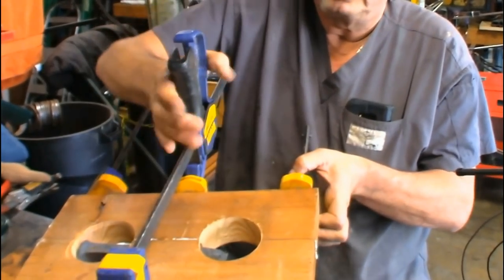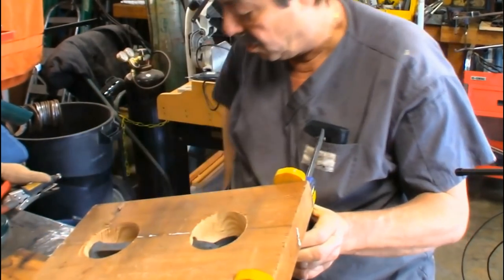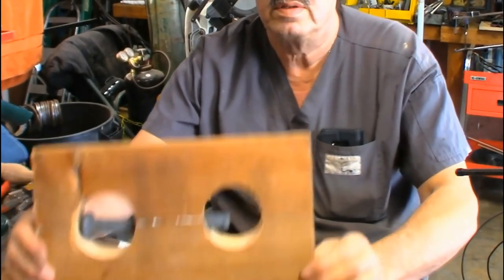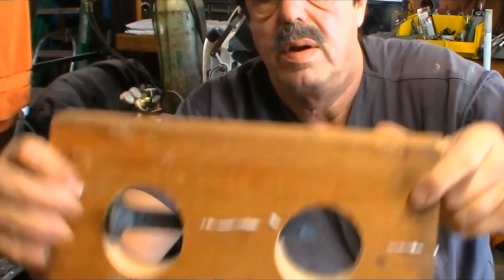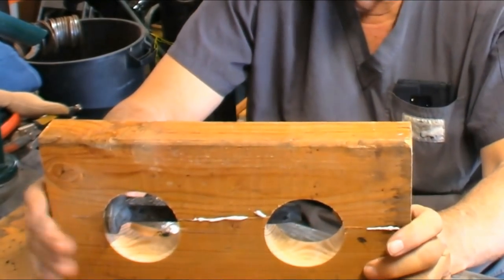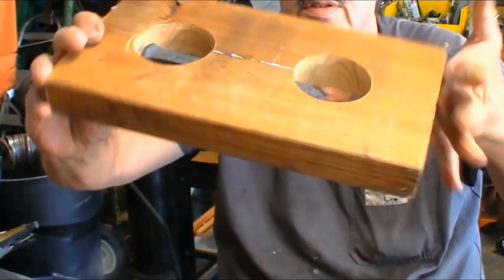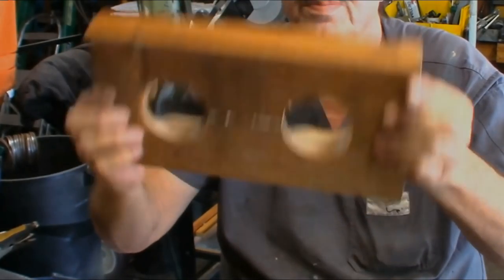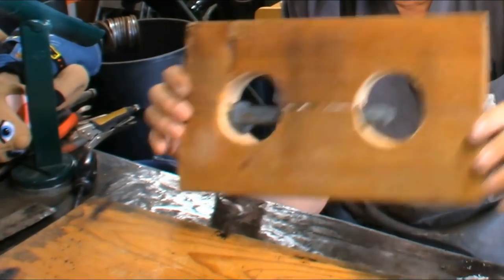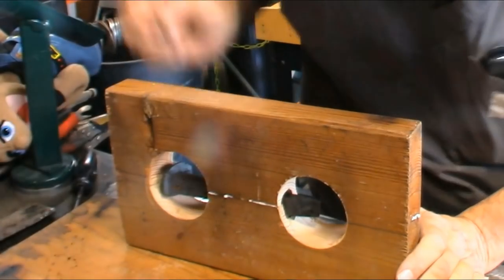Here's the other project — my microphone quit on me so I'm narrating over this. I'm going to remove the clamps from it and see if we can get this one ready for finish work. We used Gorilla Glue — it's bonded really well. The railroad tie moves back and forth, no problems. I don't like sanding with all this glue on there, so I'm going to use a razor blade and scrape off as much of the glue as I can — just be careful not to gouge the wood.